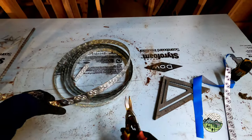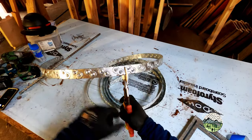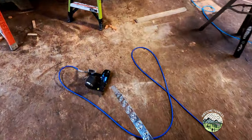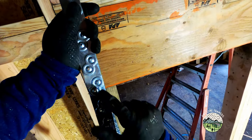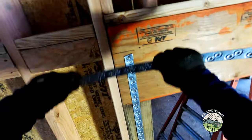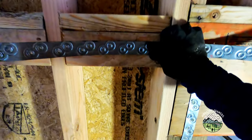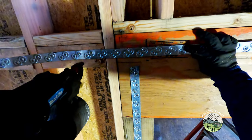I hope you find this helpful. I've got an especially long strap here. I'm going to use the Makita high-pressure coil nailer with this LVL. One thing I want to point out is there's a correct way and an incorrect way. This is the correct way — it says 'this side up.' If you look closely, you can see it kind of depresses this way. I'm going to roughly center this strap on the blocking. I like to start from the middle and work out. Then my hand is well away from it — go nice and slow.